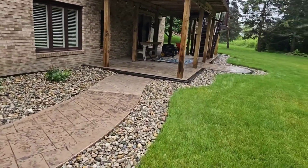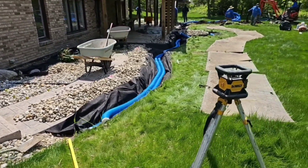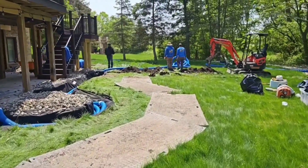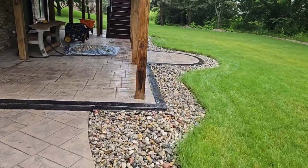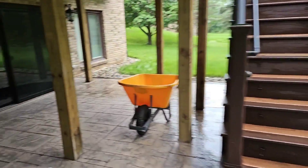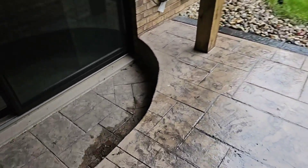The water just laid here behind this house. We're running two french drains — one along the home and one following this hardscape. There was a lot of slope put on this system. We used our laser transit to make sure the bottom of this trench has slope going all the way to the other side of the yard to the outdoor sump pump system. We have drain tile both sides of the walk, under the walk, around this outer living space. This is a forced walkout — a cheater patio. Most cheater patios have the whole level at the basement floor level, angled away with some sort of retainment — that's usually how we do forced walkouts when we build our cheater patios.